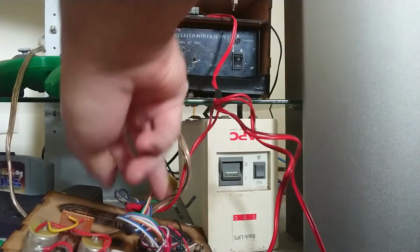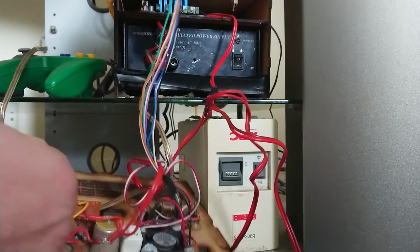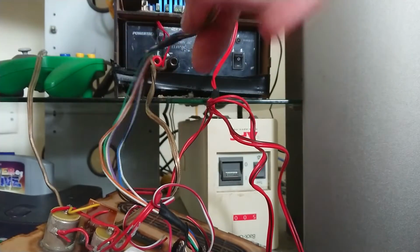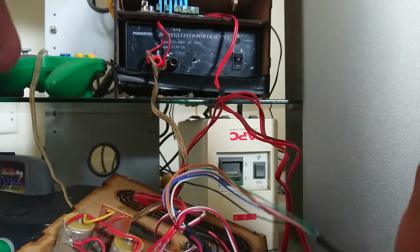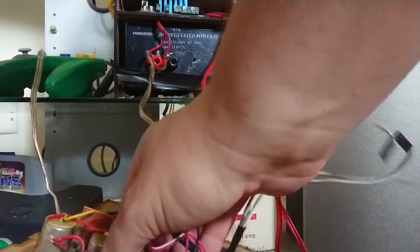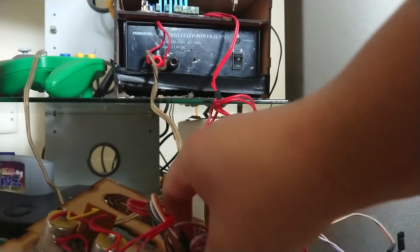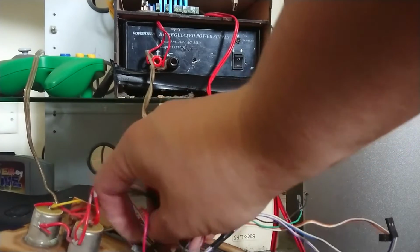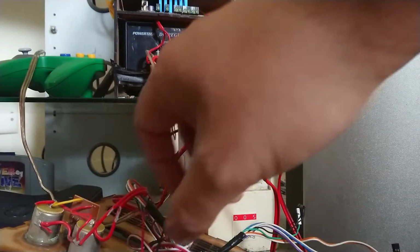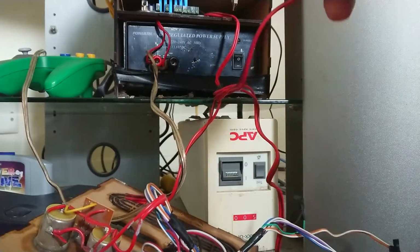And we've got a lot of GPIO leads here that I probably don't need connected to anything anymore. You know what, I'll leave them on there because I might yet program up a reset button and a few other things like a backup button. I might reuse those. The buzzer, however, I'm going to reuse for another purpose. It can come out. The fan on there is a 12 volt fan. That again, I might hook back up to GPIO for cooling. I'll do some thinking about that later. It's a noisy little thing. So yeah, the rest of that can stay.